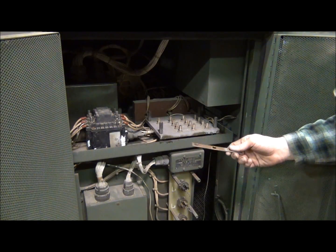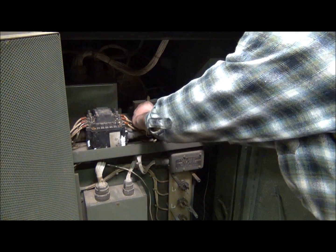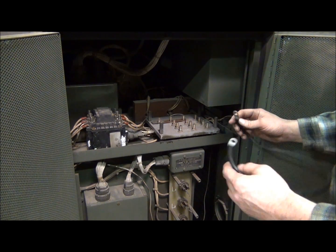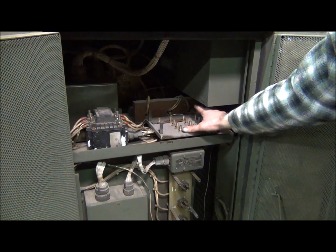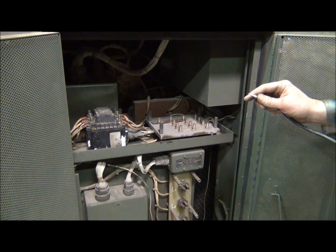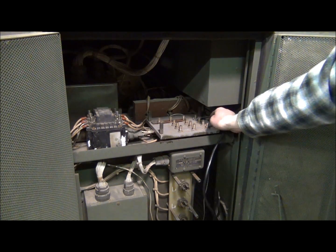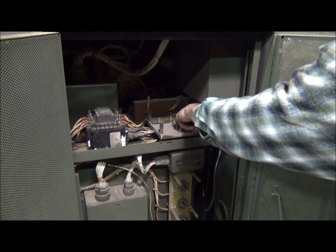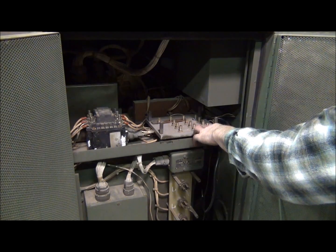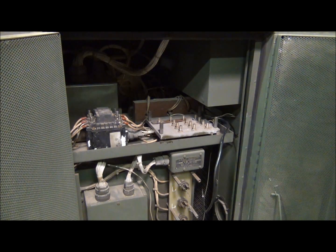I've got our modified copper bus bar right here, and we'll go ahead and put that in place back on the reconnection board. What I've got here is a short length of 6-gauge battery cable, and we're going to use this cable as a jumper to connect the lead that we disconnected back here to T2 right here. We'll put one end on before we put the board back down, because the space that this copper bar used to take up needs to be filled so that we don't warp the board down too severely. This is an ideal place to put it because it shims the board back up to the position it was in when the entire bus bar was there.